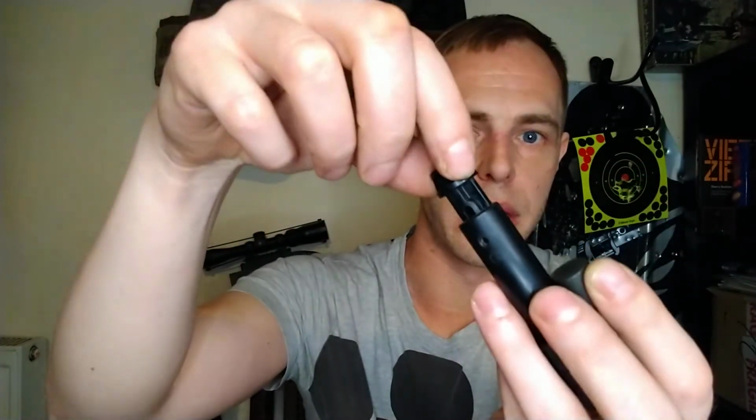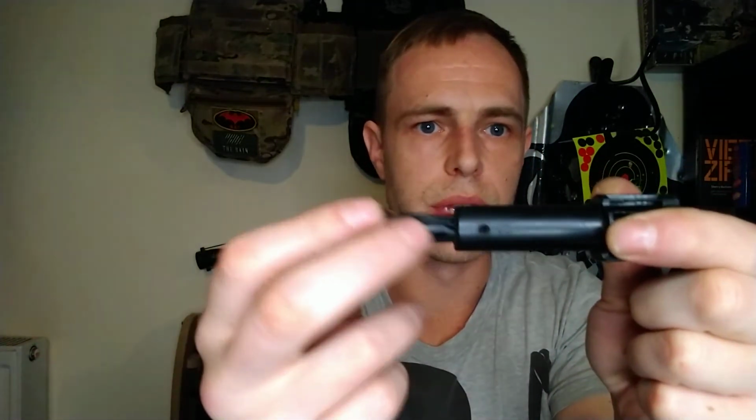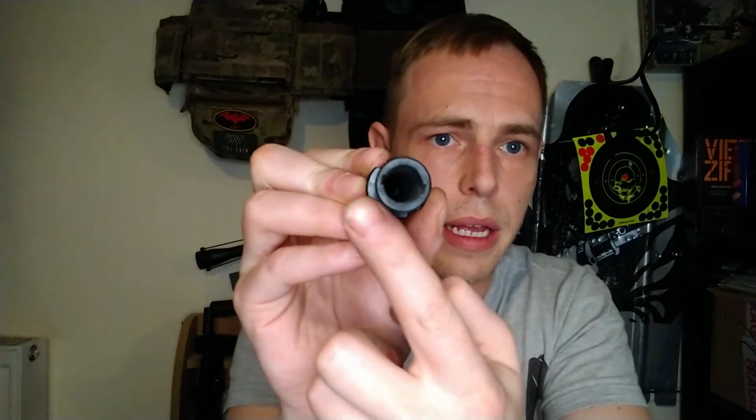The way this system works is there's a spring that goes on the spike that goes in here, then you've got little wings on the side of this bit that line up. There's no point in having the wings because you've got a pin that has to go through this hole anyway. So basically the slats you can see here and here on either side are going to be bored out. I'm going to bore this entire unit out, and at the end of it I should be left with a bunch of buffers of different weights. This is probably going to take quite a while.